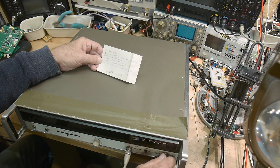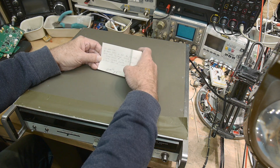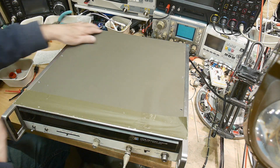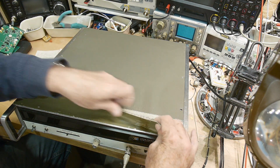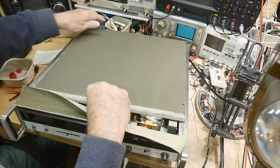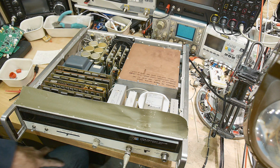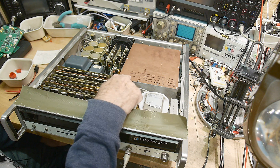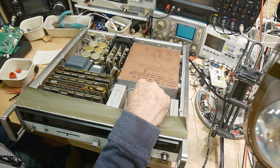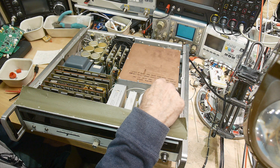We're going to have to try out the high band. I'm putting in minus 10 dBm into the input which is pretty healthy. Let's take a look inside. I've got the screws out — take the top off. Oh yeah! It's upside down. There's a handwritten note: '92/04/16 — restored to health.' There appears to be a homemade add-on board.